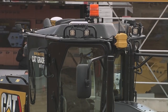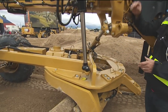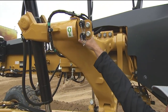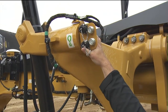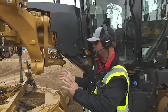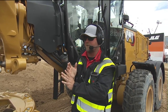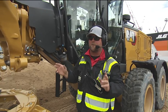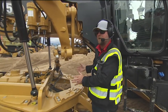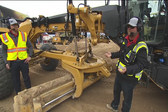Moving forward — as I was running the machine, I talked about having the capability of moving the drawbar left and right. On the yoke right here, we have an IMU sensor. Eric, what's IMU mean? IMU means inertial measurement unit — it's really just a fancy way of saying sensor. The IMU allows me to move that drawbar left and right and still stay accurate because it does the calculations needed. With a single-mast application, you need to run the circle right underneath in the center. There are many applications where you need to move the drawbar left and right, and that's the beauty of this system having that sensor here.